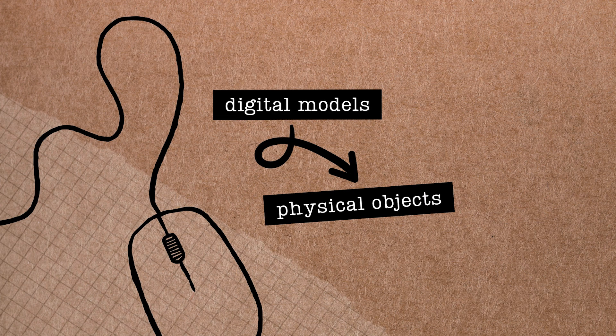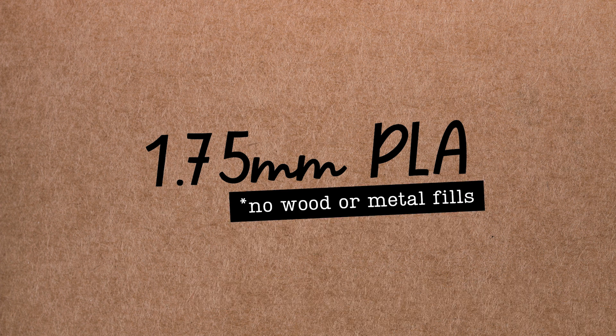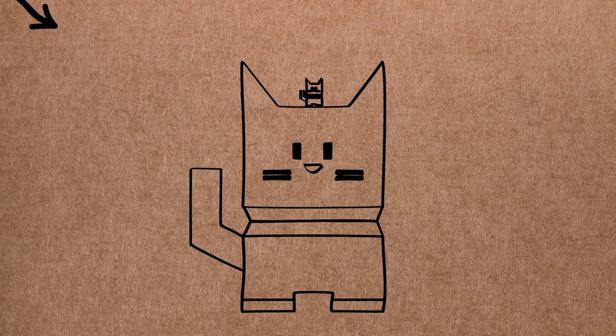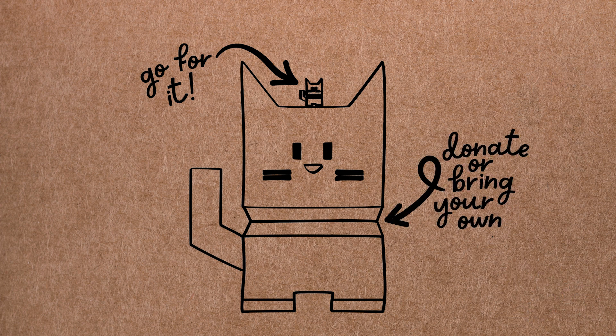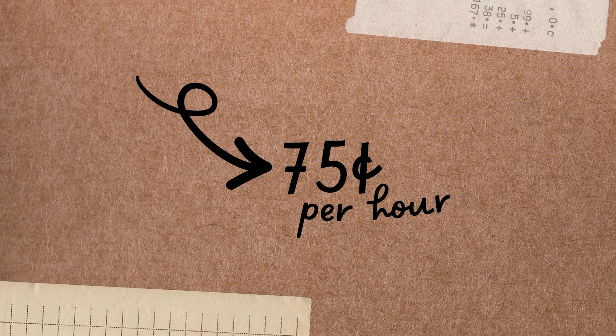Now let's take a look at materials. 3D printers use technology called CNC — computer numerical control — to translate digital 3D designs into physical objects. The nozzle, called an extruder, heats and lays down repeated layers of plastic called filament, basically like a super smart glue gun. The workshop only allows the use of 1.75 millimeter PLA, which can be purchased online or at some specialty electronic stores. We don't allow PLA with wood or metal fill. If this is your first time, you're welcome to print something small with the workshop's filament for free, but for larger projects we ask makers to bring their own materials or donate about 75 cents per hour of printing.